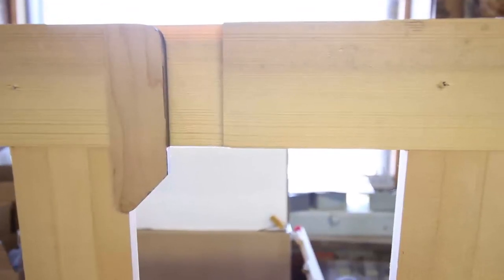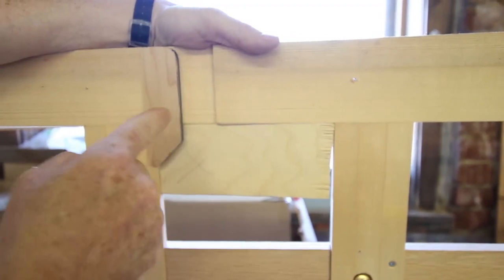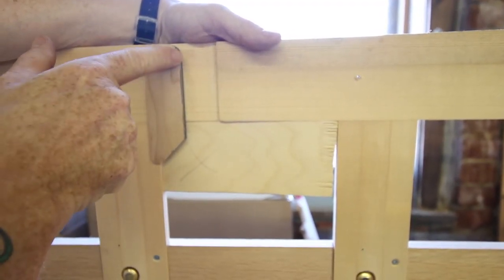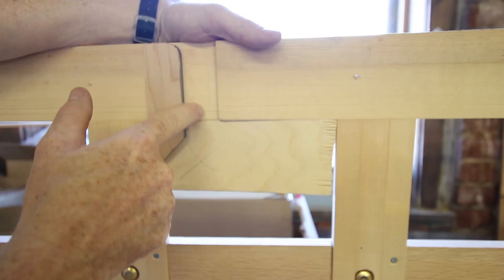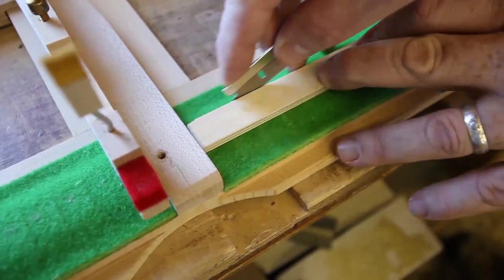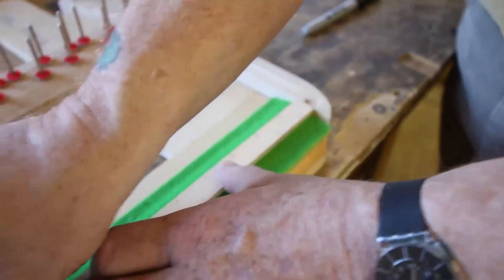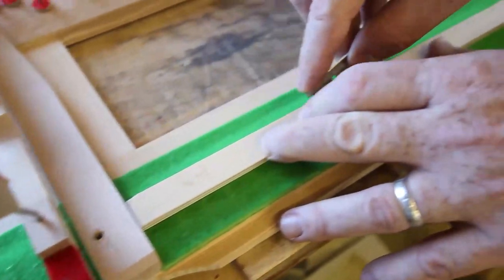Six: Cut the keyframe. Note: because of moving the shift lever forward, it is important to check the contact area on the keyframe. Please see Addendum 2 on page 79 at the end of this manual. A: Cut the back rail cloth. The back rail cloth needs to be cut back prior to cutting the back rail if needed. Use a sharp knife or razor blade to cut the line you marked on the back rail cloth earlier.